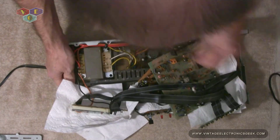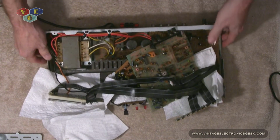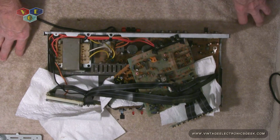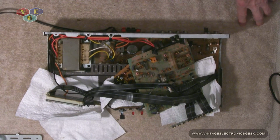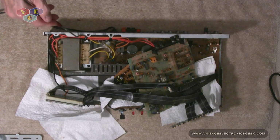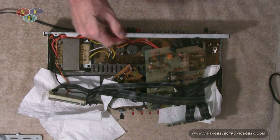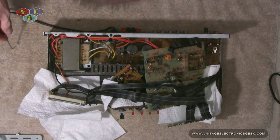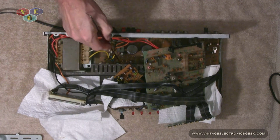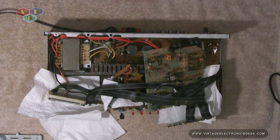I don't mind. I find that the serviceability on this coulda, shoulda, woulda been a lot better than what it was. So at which time, I'm hoping that I'll be able to test this out of the case. I'm not sure if I have to remove this or not. Get that resistor replaced, test it out of case, and go from there. If indeed it does work, and that's the only problem, this area here, then we'll move forward and replace all the capacitors.